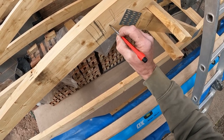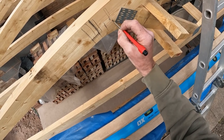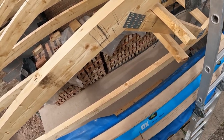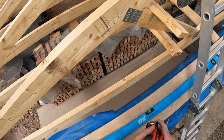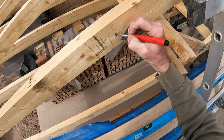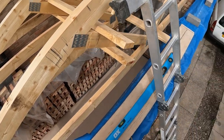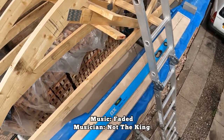That dimension there, I want that to sit against the brickwork. So that dimension, I'm not going to guess it. I'm going to overhang it 30 mil without wasting too much timber. And then when we get that on site, let's say it's 15 mil. I'll then do 15 mil at the bottom, 15 mil at the top, pull a string line and cut all these off at 15 mil. That's what I'm going to do.